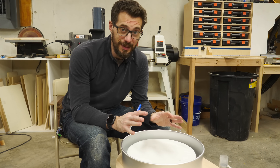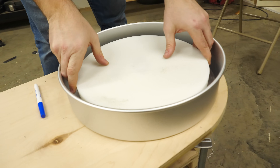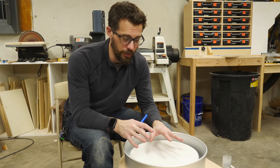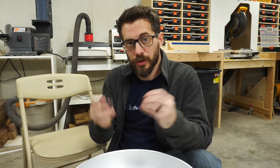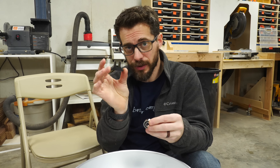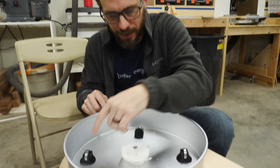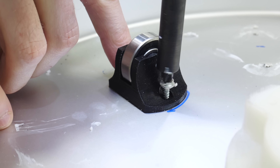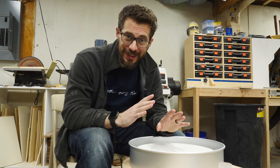After testing this thing out, we found that it was extremely loud — like almost unbearable. So we added a gasket underneath it with some EVA foam, and it's better, but still incredibly loud — you would not be comfortable doing this. So we've come up with another idea to add some different types of bearings that theoretically should be quieter. Here's where we're at with the new bearings: we've got this 3D printed carriage and these bearings, and I cut down several pieces of steel rod to go in between here — it fits right down into that. Now we've got four of these assemblies in place, and we're going to try to space them out evenly from the center point so we can screw these down and put the bat on top of them. Hopefully it'll be a lot quieter.